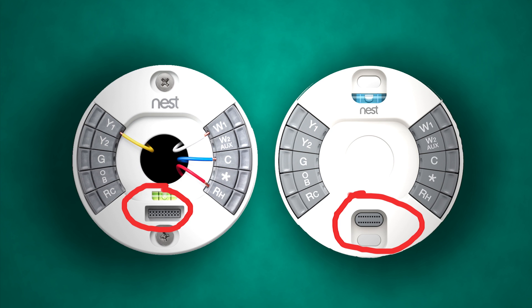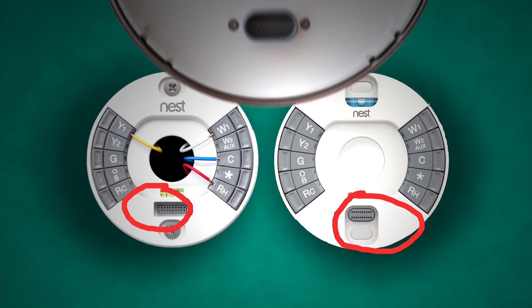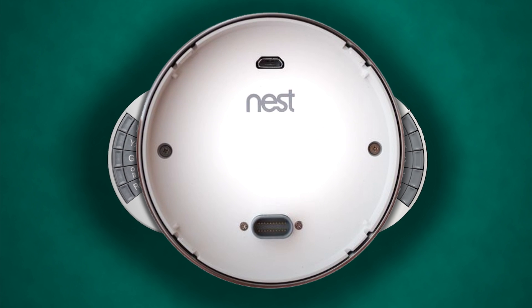Another thing I ran into: I completed the full installation of the Generation 3 and forgot to factory reset my Generation 2. For a moment I thought I was going to have to disassemble the entire Generation 3, put the 2 back on the wall to factory reset it, but I did find an alternative way. It turns out if you plug the Nest thermostat via micro USB into the wall, it will provide it with the power to turn on, although you're not done once you do that.